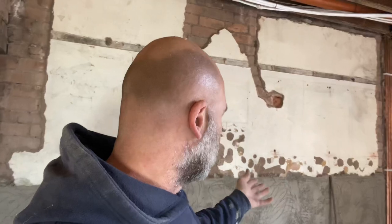Sometimes you can't put solid plaster on. I do put solid plaster on if it's like a barn or a solid stone wall. In that case I'd use a damp proofing plaster, which is Safeguard's damp proofing plaster. So if you have a look in here at what I've done down here...